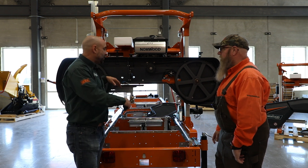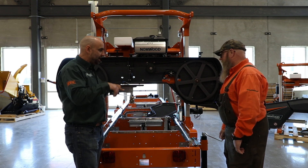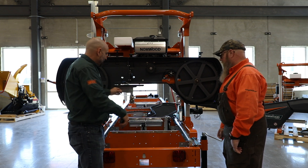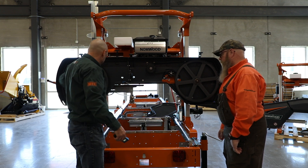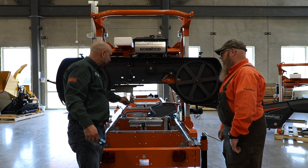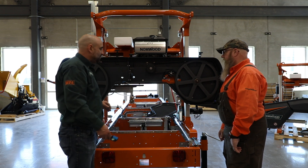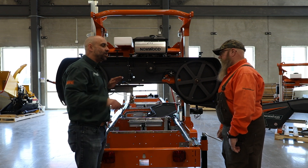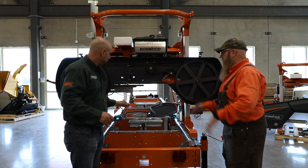We don't like crooked lumber. So once you're set up, we've adjusted the lead of the blade by tilting the roller guide, made sure it's equal down pressure on each side. We also want to make sure the roller is the right distance in and out. When the blade is tracking perfectly, we want the back of the blade to be off the back flange on that roller by about a sixteenth of an inch. When you're not cutting and the blade is spinning, it's not rubbing on that back flange. Then once you go into the cut, we want it to touch right away, because we don't want to put too much back torque on the blade — it could skip down underneath.